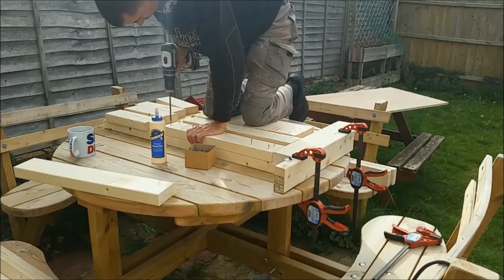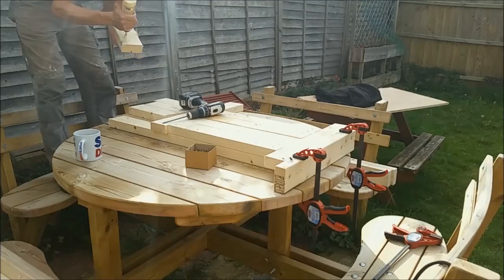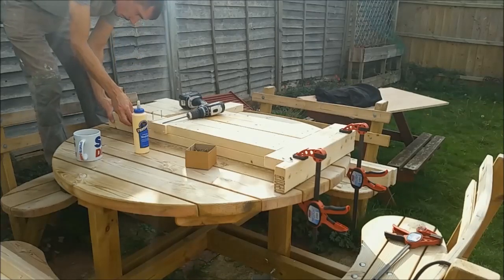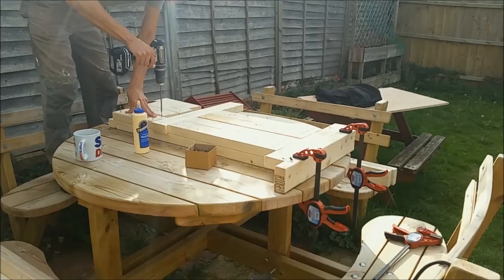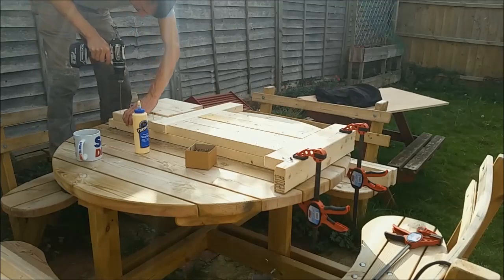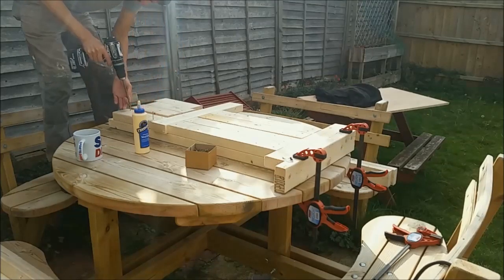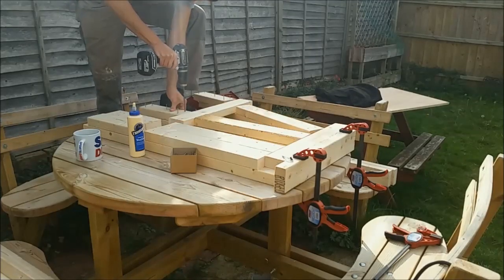I think I put 2 screws at the top, 2 at the bottom for those, and then just zigzag down the line. Once they were all done, just to do the bottom pieces, and then again using a scrap bit of timber as a guide, gluing the screw in the bottom pieces of the legs. Just saves buying a much thicker piece of timber, a much inflated price, and obviously having to then cut the notches out on 3 sides.